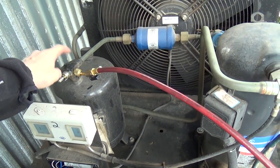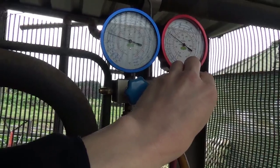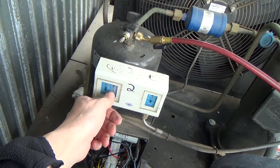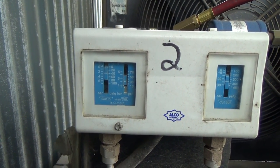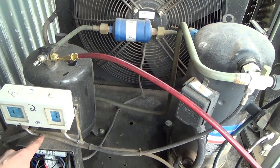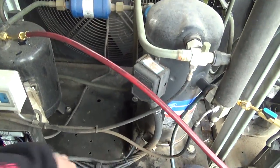We've got the line on the receiver, so we should have liquid there. We've got that line on the suction. We've got about 24 PSI in the suction at the moment — what we'll do is keep tweaking a bit until that switch kicks in. That's the high side there, it's got a preset differential. That's the low side — the cut-in looks to be about 40 PSI and the diff looks to be about 30, so it should cut out around 10. There might have been oil in the capillary — a blob of oil in there can upset where they switch, kind of plugging the line up.